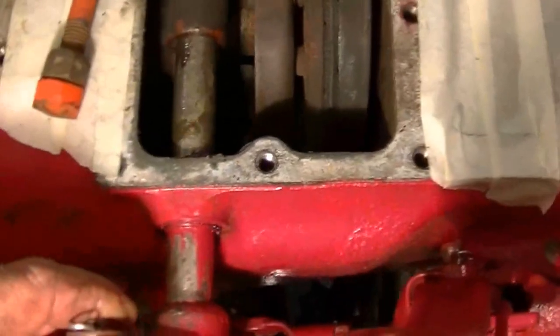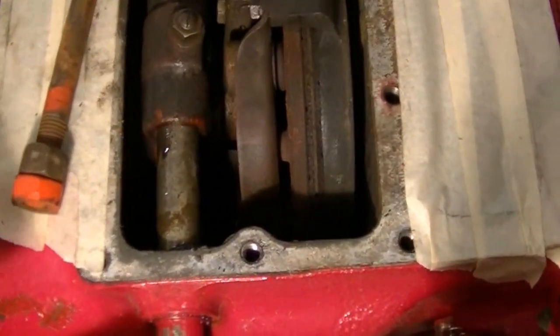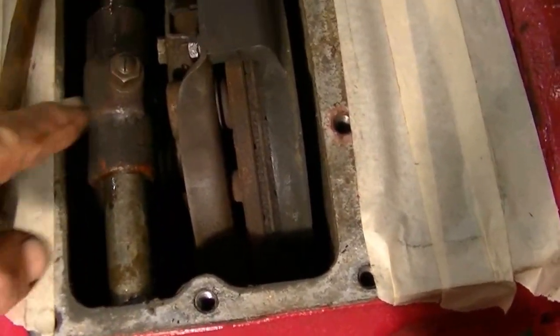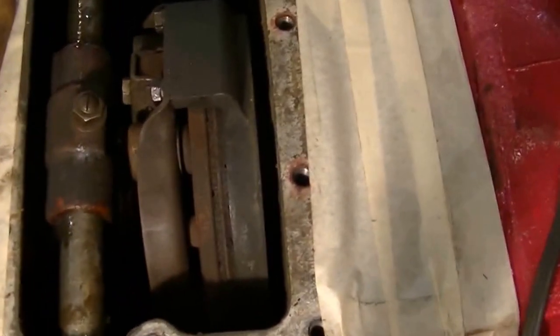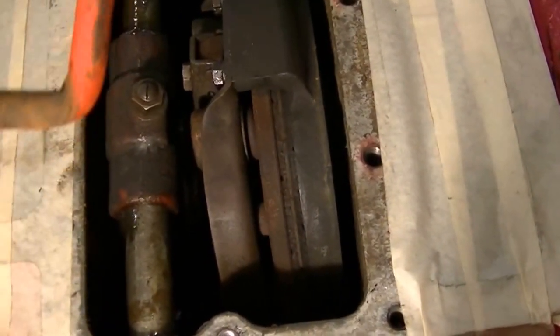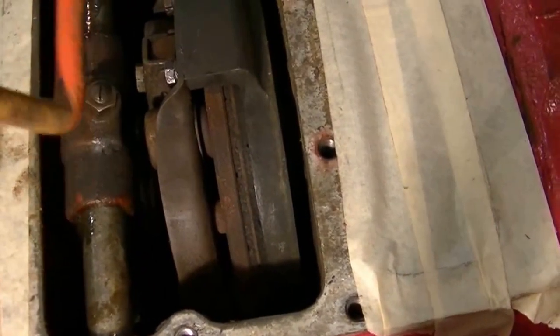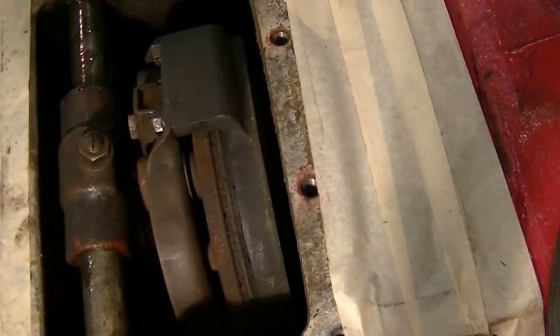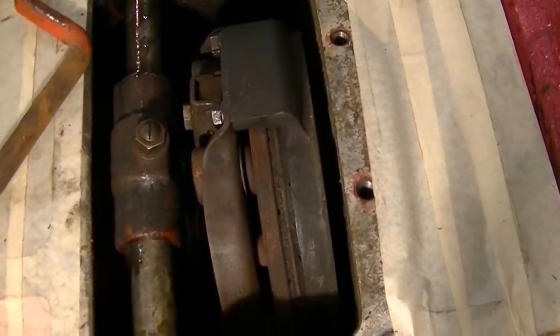I had removed this shaft since I had the unit pretty well tore down. I've had this shaft out and let the forks go away. I've set the fingers on the 7-inch Torque Amplifier clutch, and it works out that a 9/16 bolt with the bearing released and moved back in between the fingers worked out well for the settings.